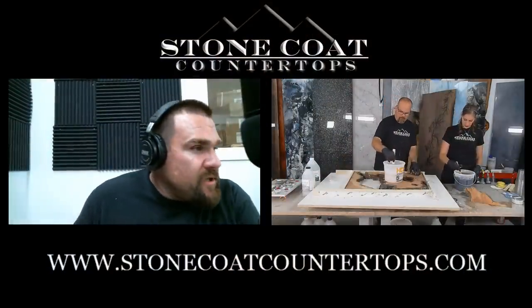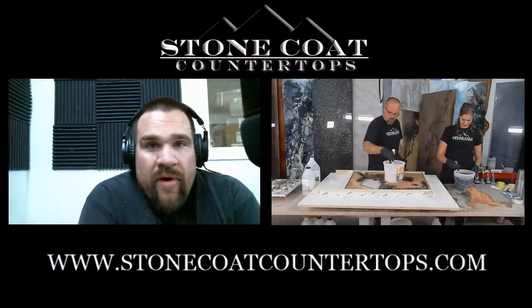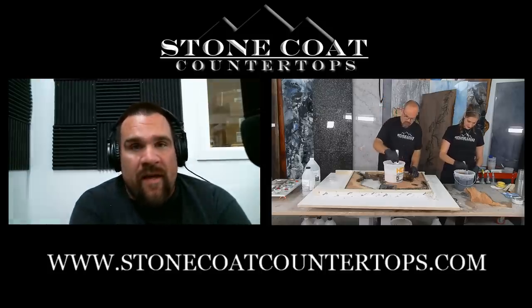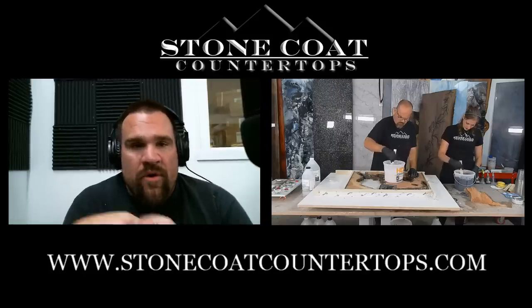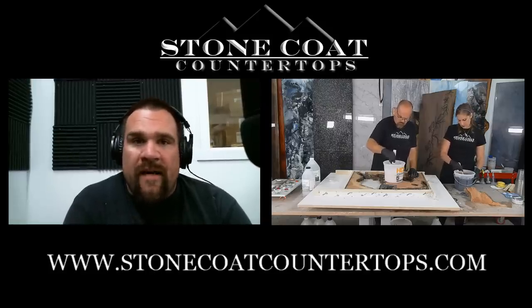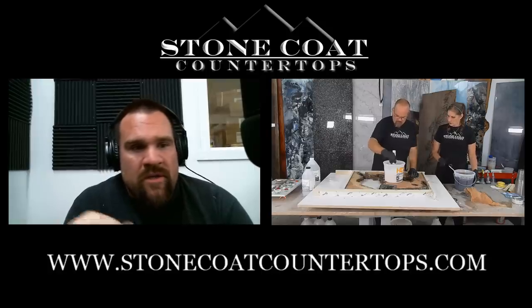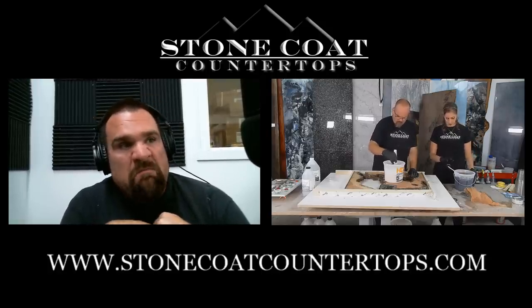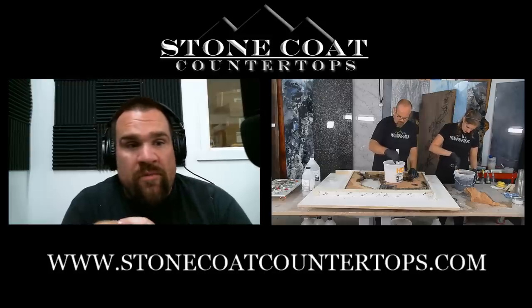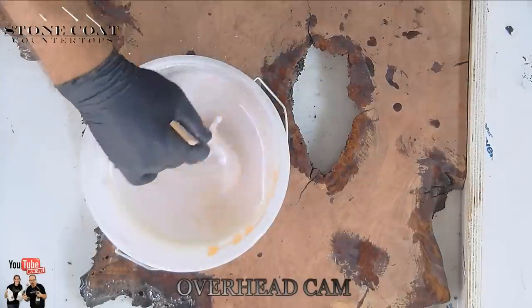So we got a good question asking, why aren't you using a mixer? The reason we're not using a mixer on any of the casting resin is we're pouring very thick. If you use a drill, you incorporate a lot of air into that epoxy, and it's going to be difficult to remove with a torch. So we hand mix, which incorporates much less air, and we're going to torch it every quarter inch or so as we're pouring it to get rid of all that air that we have incorporated in. Great question.